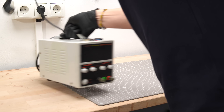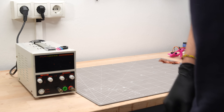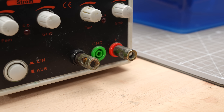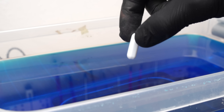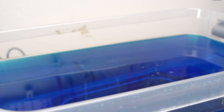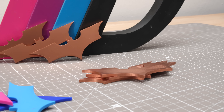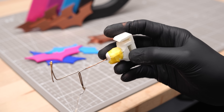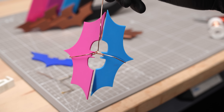Now it's time to jump straight into the electroplating. As always I use a power supply that matches the size of the plating area, roughly 1A per square decimeter. This one goes up to 5A. For the electrolyte I use a commercial acidic copper solution with a brightener additive. I connect a copper anode to the positive terminal and toss in one of those magnetic stir bars. Before I do any of that I put on my PPE — super important. To ensure the coated prints stay well seated in the electrolyte I bent myself a holder out of copper wire using an uncoated print, a sort of template.